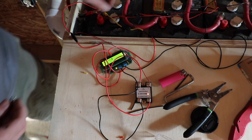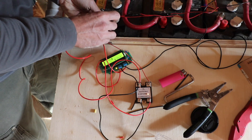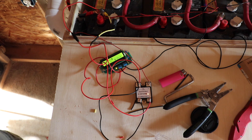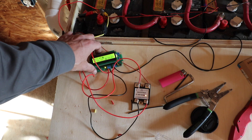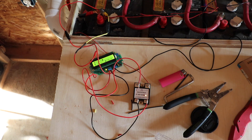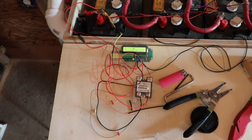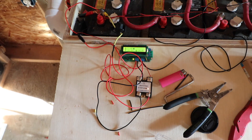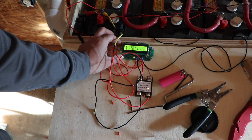Let's put a little 1 amp fuse in here. It's over 26 because I'm in absorption — I'm at like 29.5 volts. Let's see if it goes off when I drop — turn off all the solar, just testing it, see if it turns off. It's going — I'm waiting for the voltage to drop to see if this thing turns off when it gets under 26 volts.